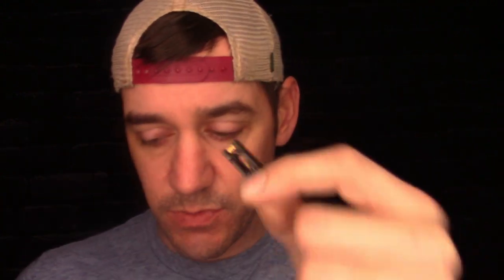I've also tried to not use a roller saddle. The first time I attempted it, I used just a regular saddle, and the problem I was having was the string was wearing a groove into the saddle, which eventually snapped the string, or threw the intonation off on the guitar. So I was having trouble with that, so I decided to use the roller saddles, and that's what I came across here.